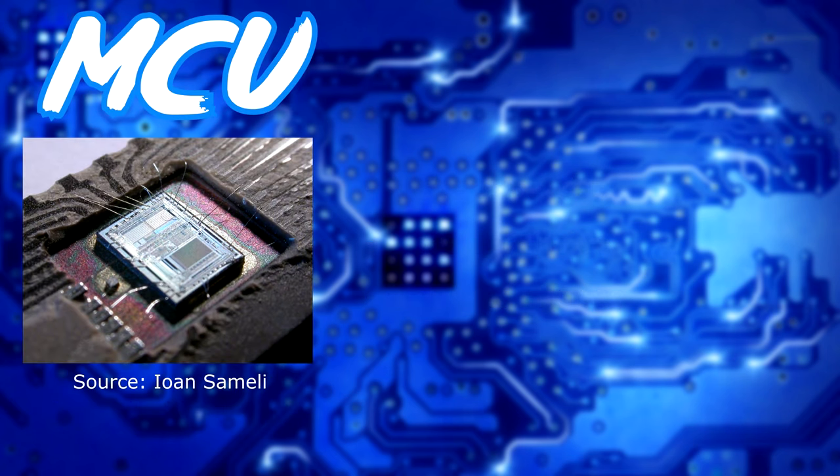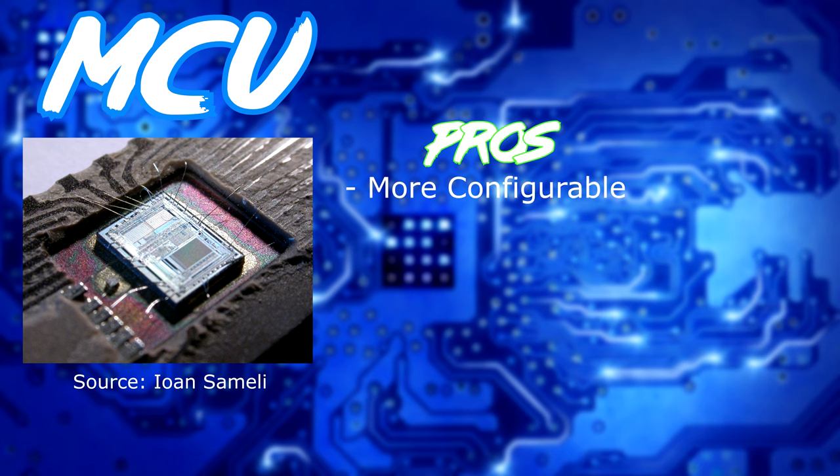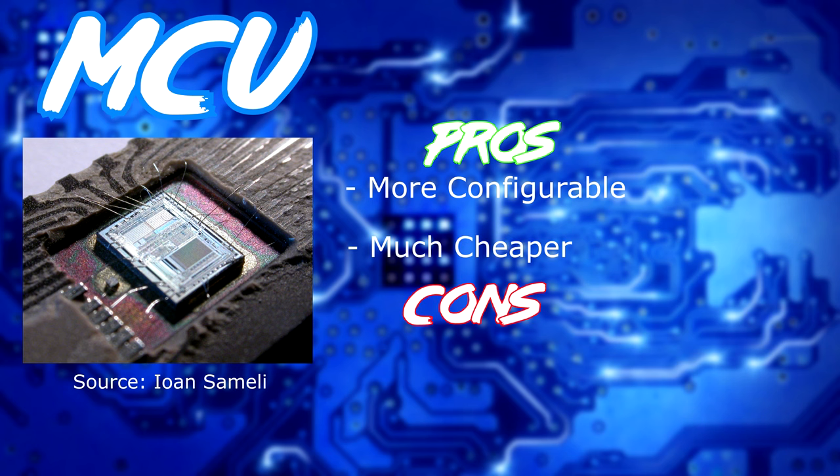You could also go with a microcontroller or microprocessing system. If you design it this way, the system is infinitely more configurable and much cheaper. However, you're going to suffer on the performance side. Even with today's modern microcontrollers that can get up to close to half a gigahertz of clock speed, you're still going to have a lot more overhead, and you'll need a lot of supporting circuitry to help with that, which can end up being just as expensive, if not more. While it's field programmable and not locked into a design, sometimes it just doesn't meet your performance needs.